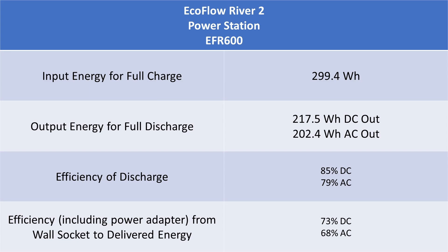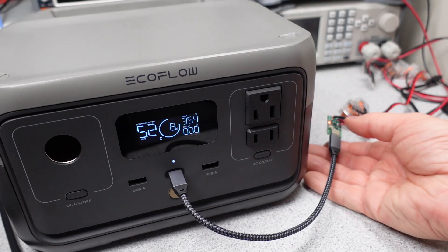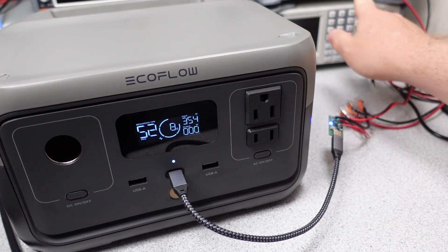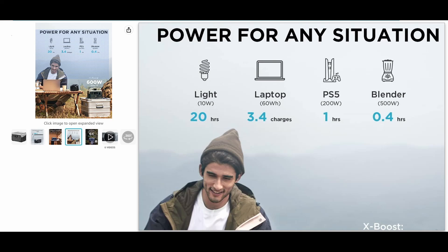This is not the best but it is still a strong performance on the DC side. On the AC side, compounding losses are not so great for a smaller unit like this. The charging on this power station, which tops out at 330 watts, was also good but the charging efficiency ends up around 86%. This lost energy is the price you pay if you need portable power. If everyone used this power bank in between for AC to AC, you'd need about 32% more grid capacity. The charging time was well within requirements, and in terms of the marketing claims for outputs, this power bank meets the basic requirements claimed. Real world performance does vary and will certainly be lower on paper, but this power bank looks good for running the claimed devices for the times mentioned.